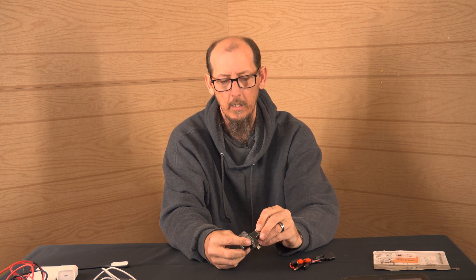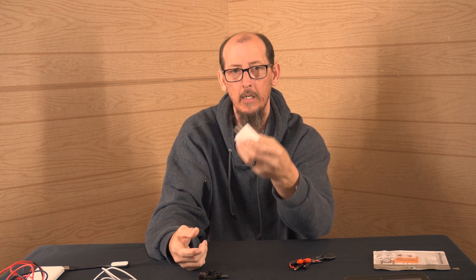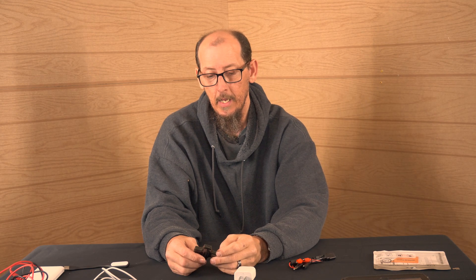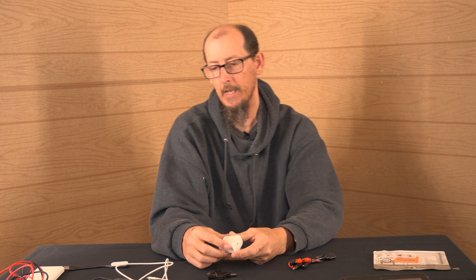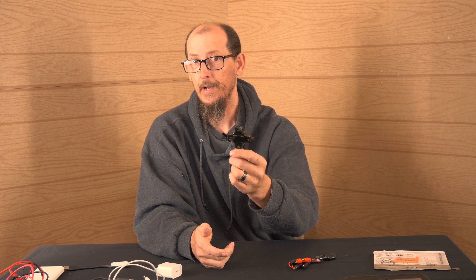And that's where I was going with what this thing is actually being used for. In conclusion, this thing's pretty neat. It will tell you whether or not you have a bad power pack. If the USB ports on your computer are starting to act up — your mouse or wireless keyboard is acting up — you can plug this into your peripherals and see if the voltage and amps are drawing what they're supposed to be. It's really cool because sometimes you think your phone charging brick has gone bad, you buy a new one and it does the same thing, and come to find out it's just a bad power cord. This is a great tool to troubleshoot that stuff with, and it's only 25 bucks — or free if you stay this long.